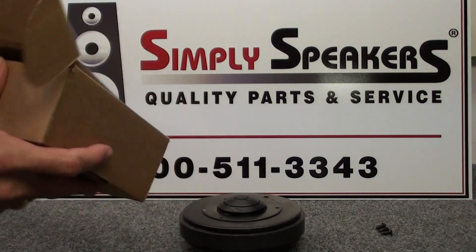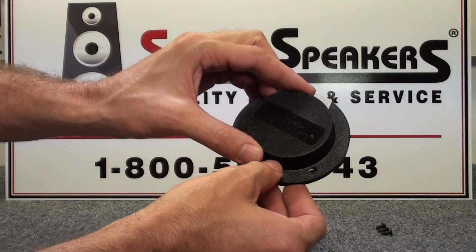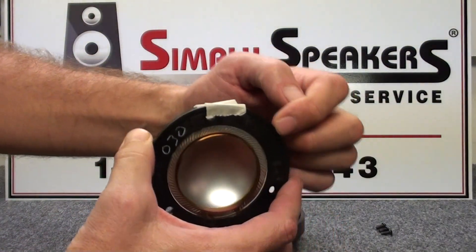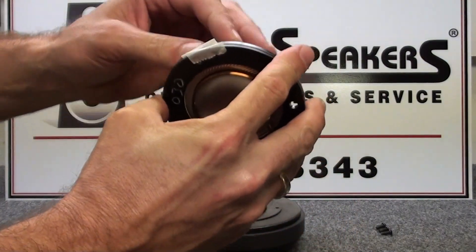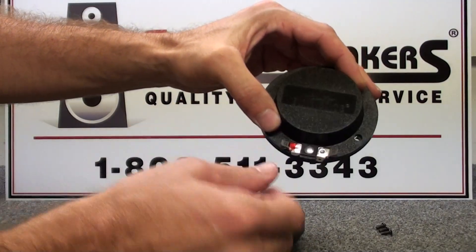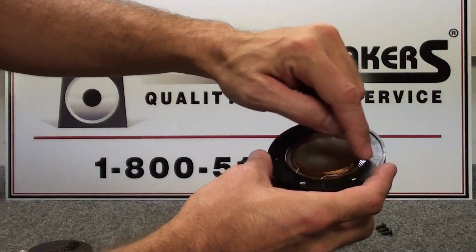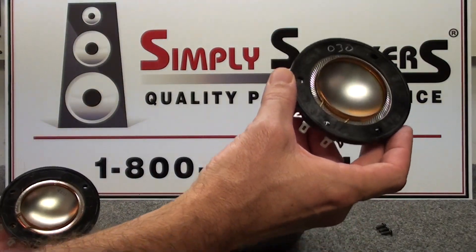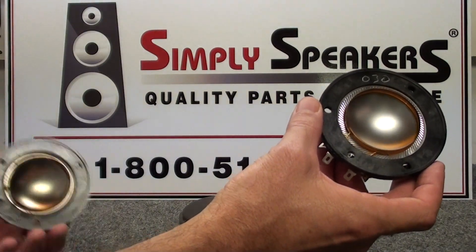On the new diaphragm packaging, when you take out the new diaphragm, you'll notice it says Eminence on it — and that's okay. It doesn't matter what brand you're replacing; they're all the same, made by Eminence. There's a piece of tape in the packaging to prevent any vacuum buildup during transit between the back plate or air chamber and the front plate — we'll want to remove that first. It usually just peels right out. The new diaphragm is already marked for the positive connection, just like the old one. The difference is the new diaphragm has a ribbed suspension built into the assembly, rather than just a V groove — this is the type 2 diaphragm, now used in all of these drivers, offering a little better frequency response and stronger construction.